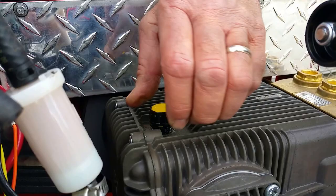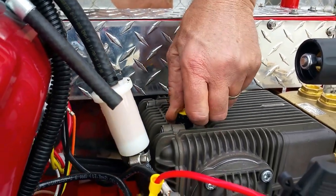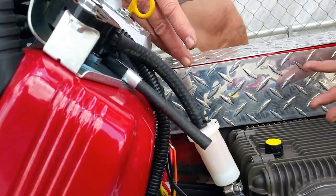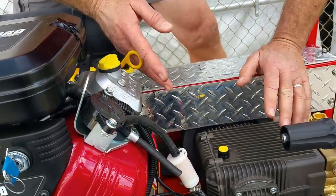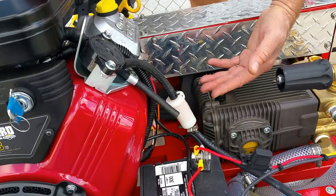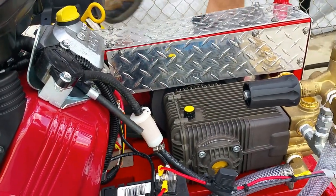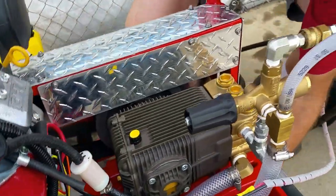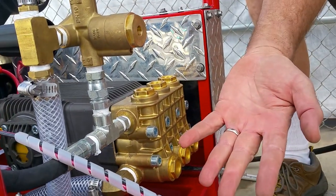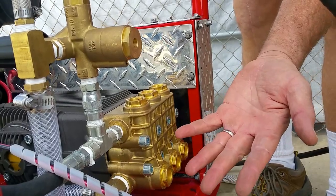The two rules around pump systems are: number one, no leaks on the water side; number two, no leaks on oil. Never have oil leaking from the engine or from the pump. This is a check you do every day — put your hand underneath the pump and make sure there's no oil and no water on your hand. Just put your hand underneath the frame. If you don't see any oil or water on your hand, then turn the water on, plug in the gas, start it up and clean something.